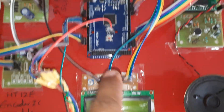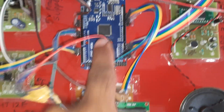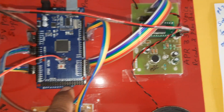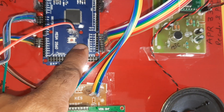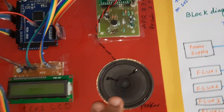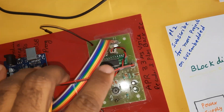This is the programming port and reset button. The 16x2 LCD character display is connected to GPIO pins 8 through 13. The voice module outputs are on pins 14 through 21, connected to the APR33A3 voice recorded and playback IC. This is an 8 ohm speaker.